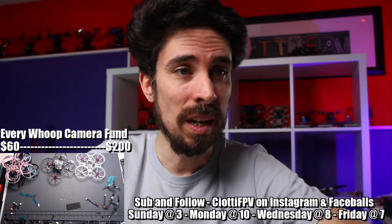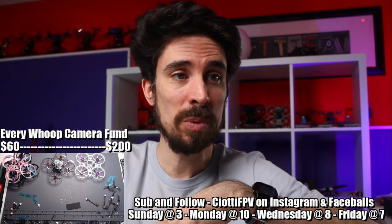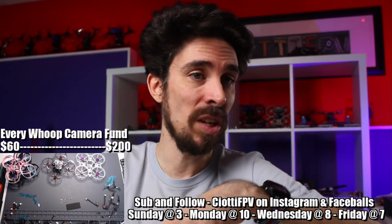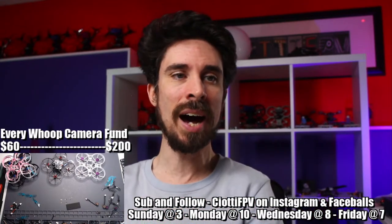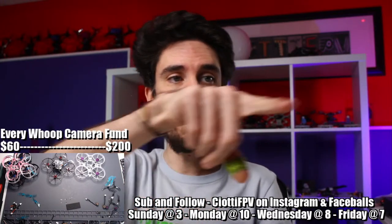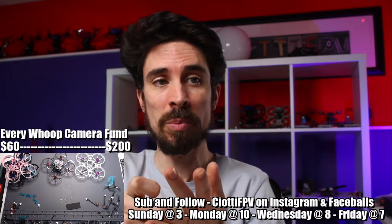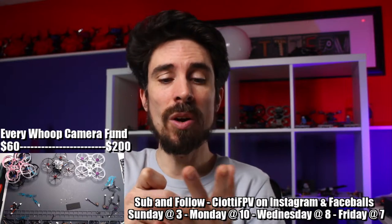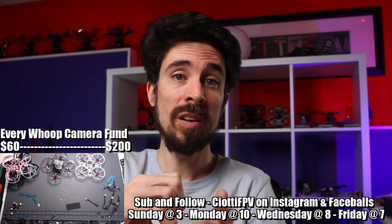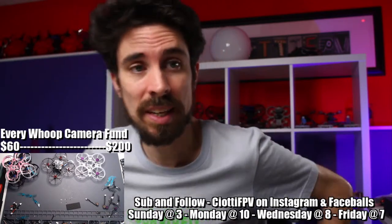Gray Hat says, I don't know if you missed reading it. If so, disregard. The number is HDZero. Yeah, this is what I need. 14.1 milliseconds at 90 frames per second. 19.7 milliseconds at 60 frames per second. And then they're using 18.7 milliseconds for analog. That's a little high. You can pretty easily build an analog system that's less than 18.7. But the number that matters there is 19.7, call it 20 milliseconds at 60 frames per second. So HDZero for a digital Tiny Whoop is going to give you 20 milliseconds latency. Walksnail on a digital Tiny Whoop is going to give you 30 milliseconds latency. That's a big deal. 10 milliseconds is a big deal.